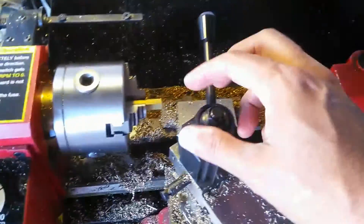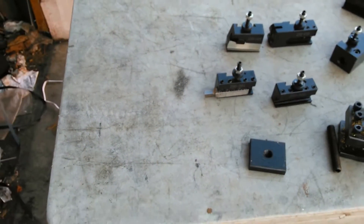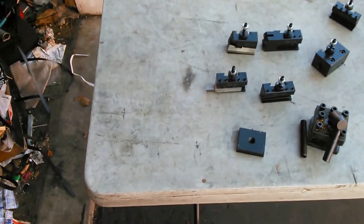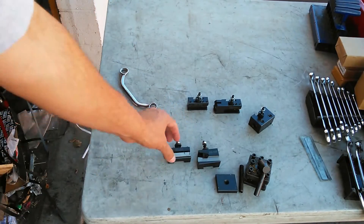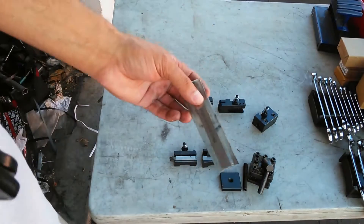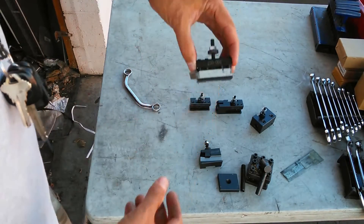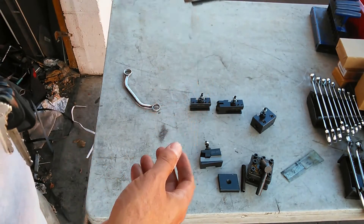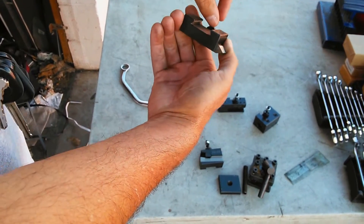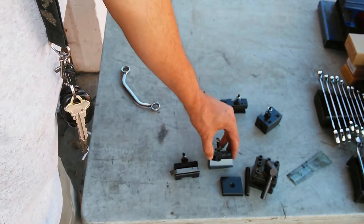The tool post is in place. I'm going to grab one of the tool holders and show you how it drops in. Now I've set up the cutting tools — this one is set at the right height, and so is the one in the chuck right now. This holder here is for side cutting or for the parting tool. The way you set the height up and down is with this wheel — you turn it to raise or lower the shank, then lock it with this screw. When you put it in, it gets a positive lock, seats against the bottom, and that sets the tool height.